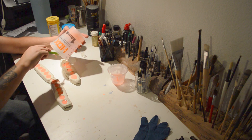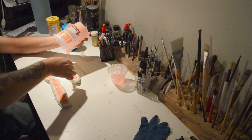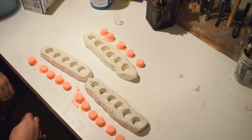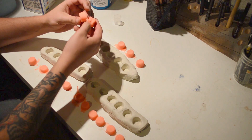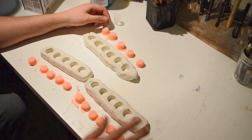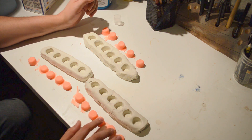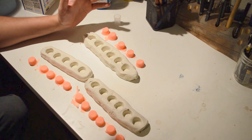I'm probably not gonna use all these registration keys on my mask, probably just a couple of them, but I'll have these for future use and it'll save me some time later on. The main part of this experiment was just to see what the silicone does and see how big of a mess I'm gonna make, so when I do the large scale I'll be prepared. It's been about six hours since I poured these and I just popped them out. Sure enough, like they say, silicone doesn't stick to anything but itself — they came out really easy. A little bit of residue left over but I just gotta wash that off. For the small-scale testing: the alcohol, the odorless mineral spirits, and the compressed air duster residue — none of that stuff will inhibit the platinum-cure silicone. That's a good thing to know. I was worried I'd put this stuff on my mask and not have it cure, which would pretty much ruin the mask.